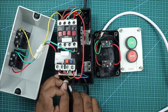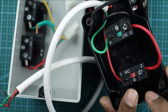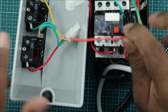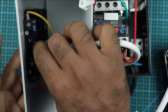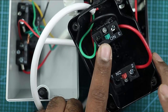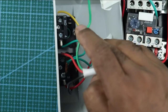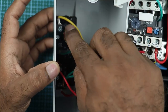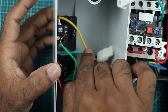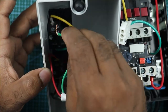Let's insert this cable here. At this NC contact, the input supply to the NC contact is given through the red wire. Take this red wire and connect it at the output terminal of the NC contact here. From this stop push button, the output supply will first go to the start push button, and from here it will be further supplied and received in the green wire. Take this green wire and connect it with the output terminal of the NO contact, because the power supply which comes to this point will be further supplied through the yellow wire to start the contactor directly.